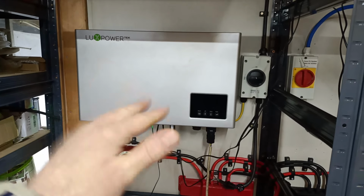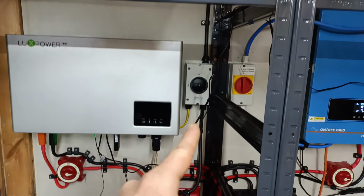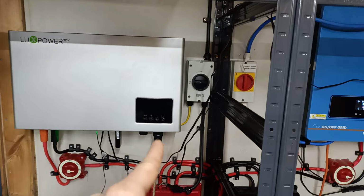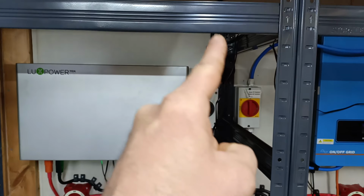I've been all around the meter cupboard with the CT clamps. The solar CT clamp works absolutely fine. The grid side of the CT clamp has been absolutely dead as a dodo, unresponsive. The original AC feed came in from the solar PV sub-consumer unit that all the grid-tied stuff in the house is tied to.